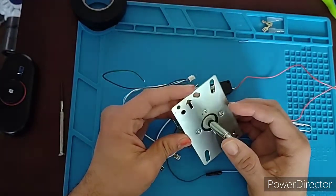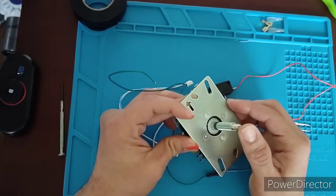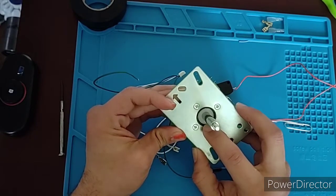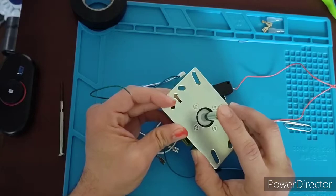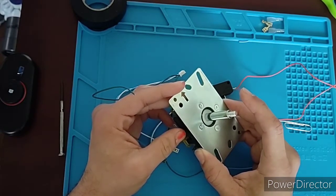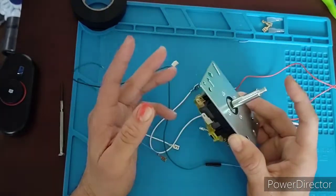And another thing I'm going to be filming is some maintenance work, because you will have to add some silicone grease to this pivot point on all Japanese-based joysticks, including their clones, which off the top of my head, I'm speaking about Sanwa, their clones, Seimitsu, and their clones.